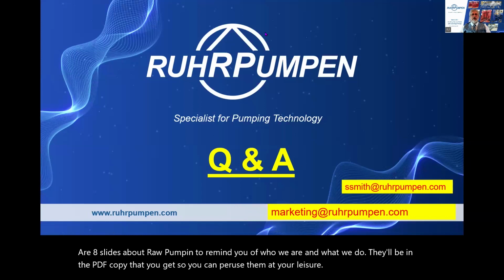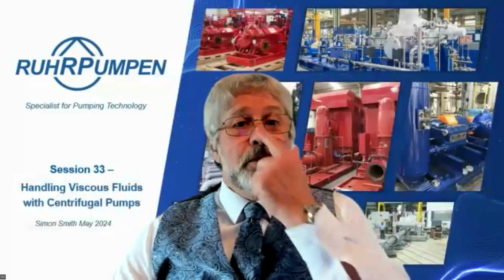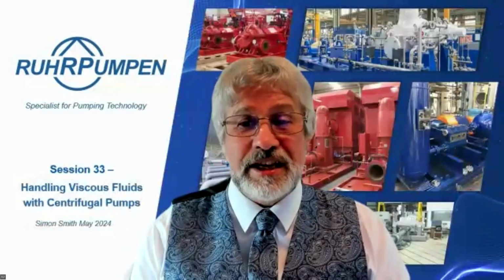Now, let's have a look and see what we've got in the Q&A. So far, just two. Shima Faraji asks, can we use it for sludge as well? What's the viscosity of your sludge? You can enter the data into the calculations according to the ANSI standard and see if you get a parameter B figure less than 40. Maybe you can handle it. It depends. Define sludge.